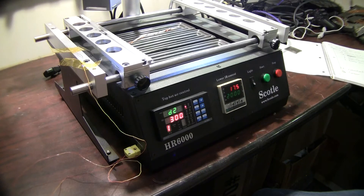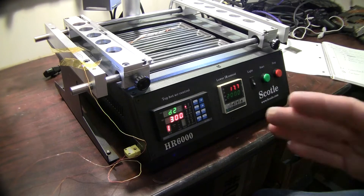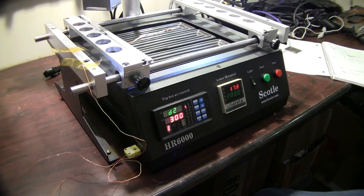So if you have your profile — if you bought a profile from Spitfire Mods, you're going to have those stages on your sheet. The R value is typically set to three, so that's an easy one and it's always set to three no matter what stage you're in. Your D value and your L value are your dwell time and your temperature. Your L value is going to be the temperature for that stage, and your D will be your dwell time — the time you want it to take to get to that temperature.